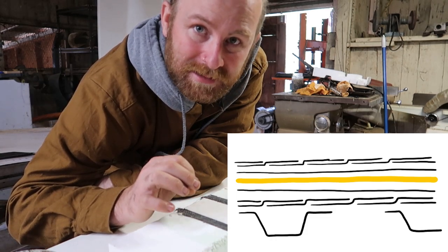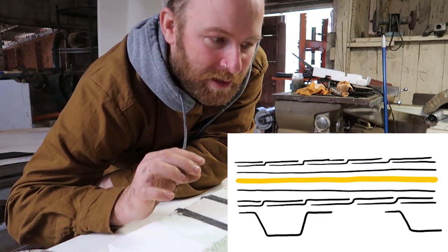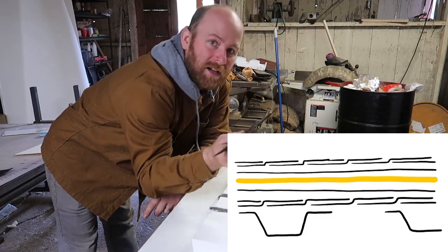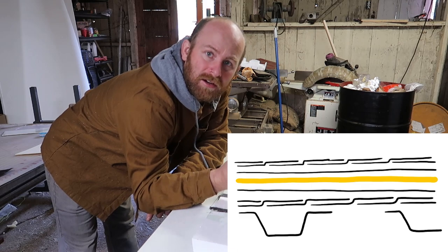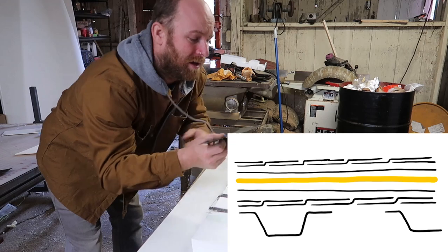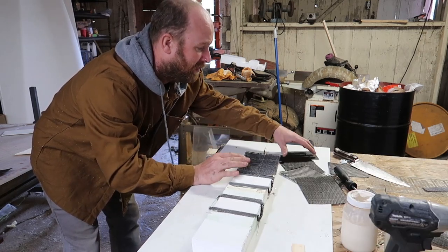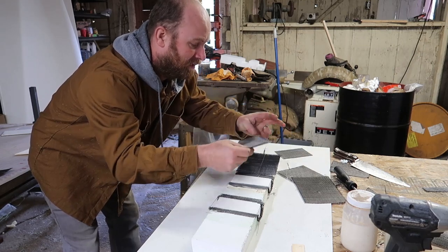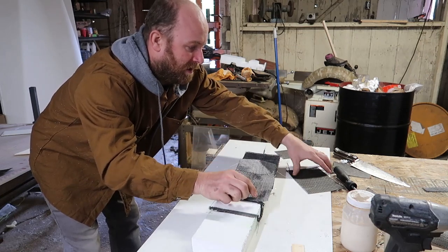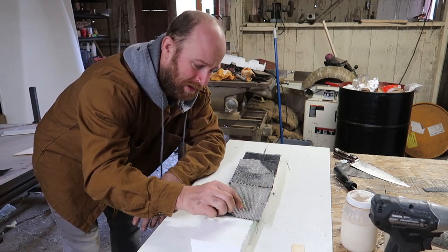After that, we'll have the Divinycell foam, and then we'll have a diagonal of 45, and then two layers of 0/90. As I lay down the first layers, I'm gonna design it so that they're almost like shingles, like a 50% overlap for the first two layers. This will create kind of an S curve from the side profile, but it will allow me to get two layers out of the first layup process, and I can get a very good bond between the two layers by overlapping them.